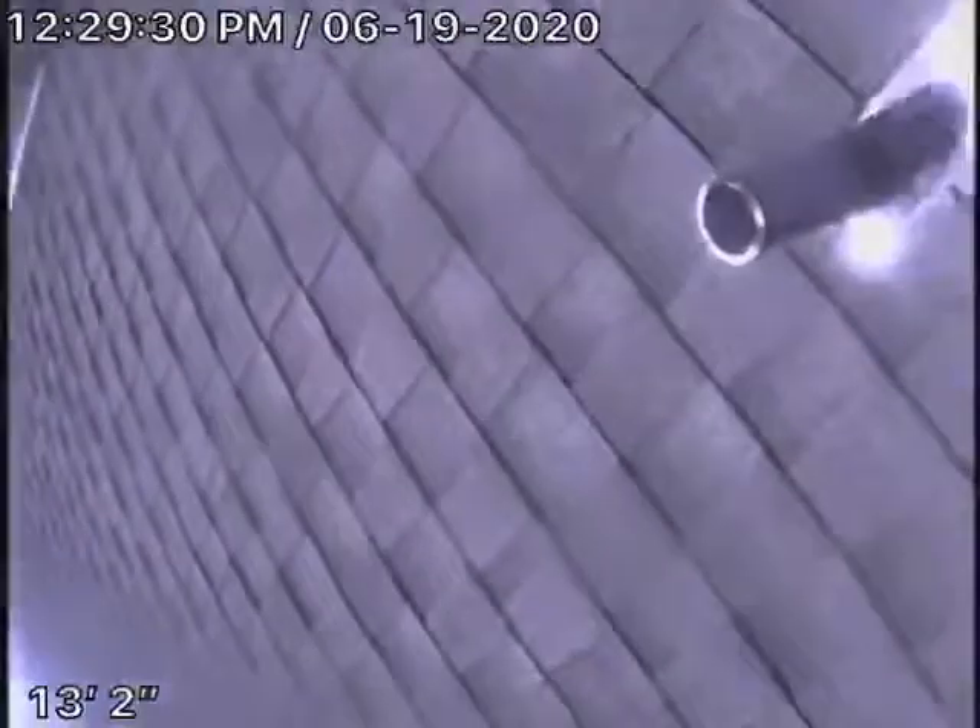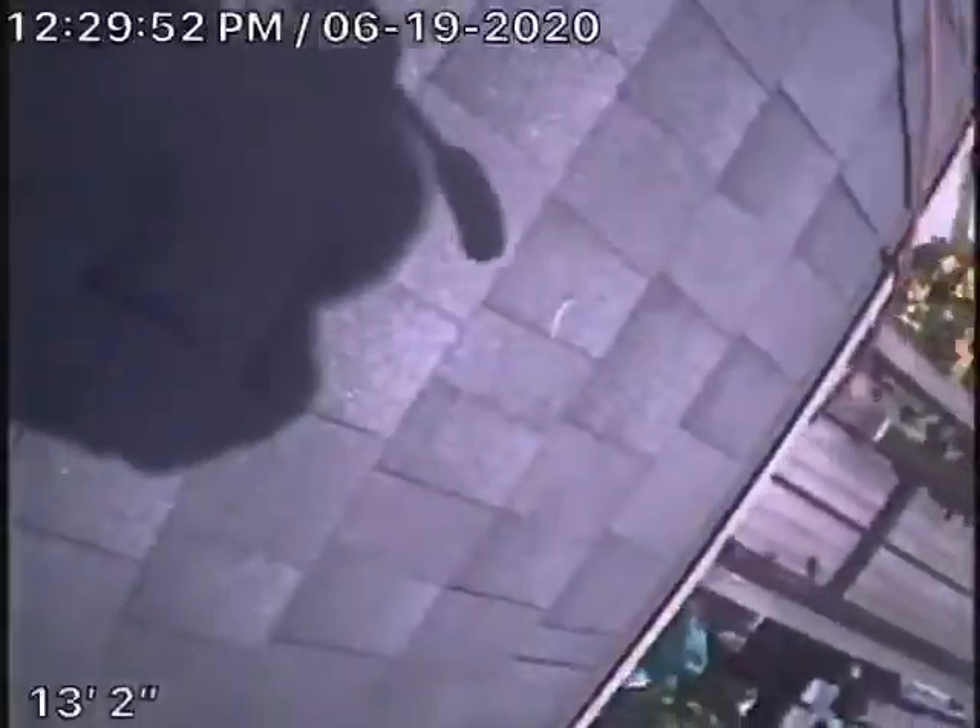I want to see if I can check the main line going underneath the main house. We've tried the roof access on the right-hand side of the house but there's nothing allowing us to go in, so that's about all we can check over here. We're going to highly recommend that you have the general inspector check the plumbing underneath the house. For the left-hand side, the original part of the house, we cannot check anything over there. Make sure everything is draining properly. You may want to install a clean-out from underneath the house to the outside so that this can be inspected properly, but there's no way for us to check anything underneath there.